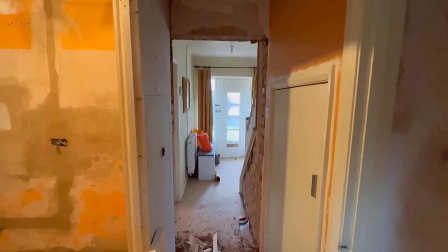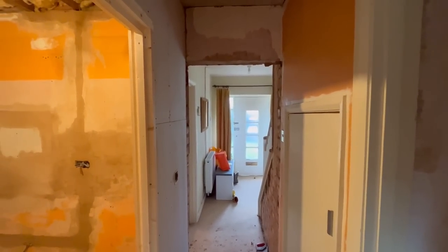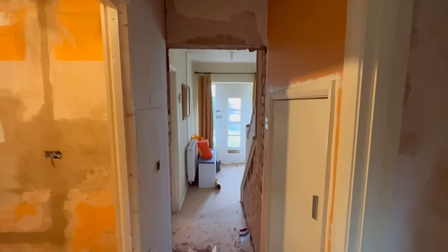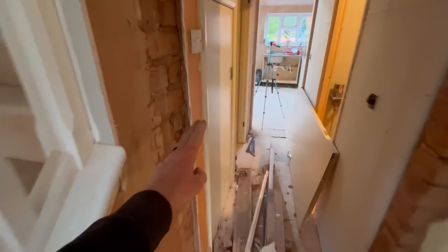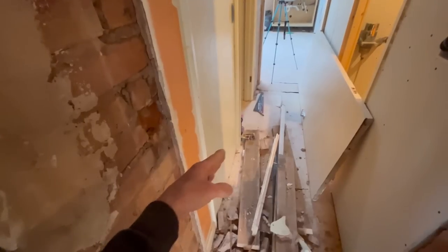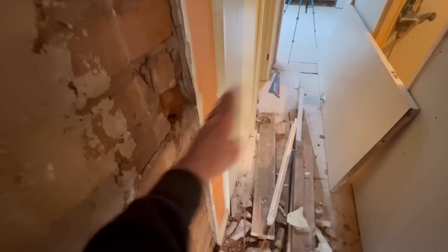That's out then. So there's nothing interesting about that. However, just a couple of points for you if you're taking this out yourself and you don't quite know the best way to do it. All I have ever done, and I'll stand corrected, I always cut my frames at an angle, so when you're trying to lever it off, it doesn't get stuck in itself. If you cut it square and try to lever it, it'll bind on itself. Cut it at an angle. I always go down and then pull the bottom out first.